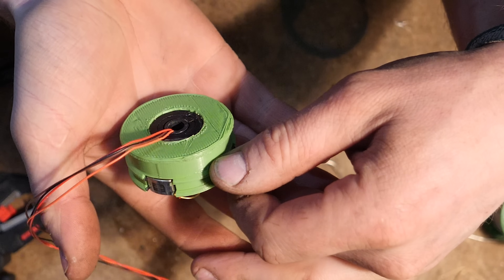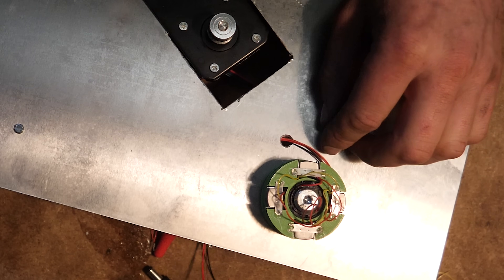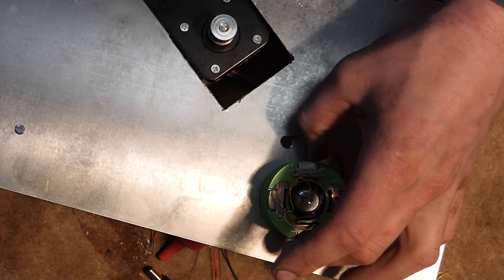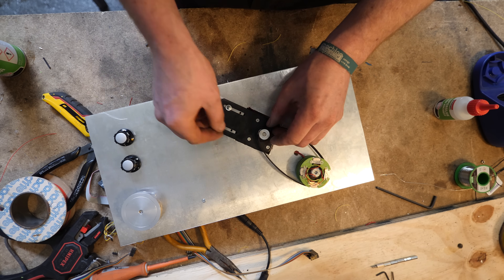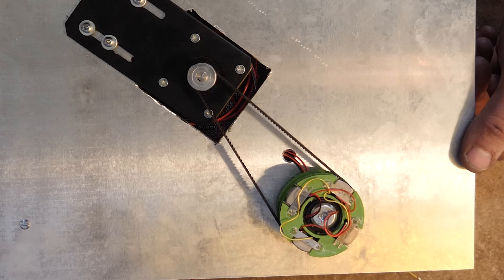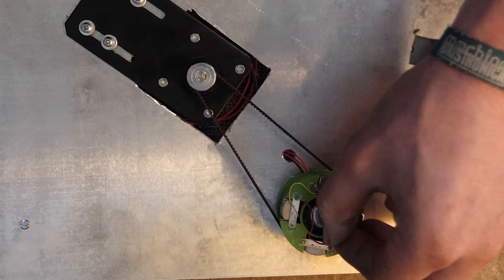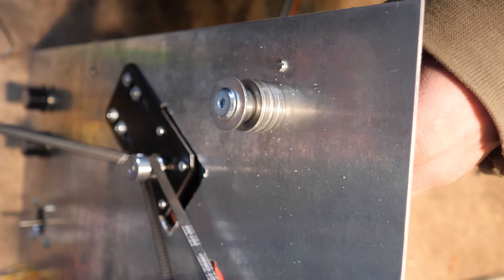It actually works. I've wired all of the tape heads in parallel so they're literally acting as the same tape head, and I'm quite pleased with that. It looks a bit rough but it is functional and that's all that matters. As you can see it's spinning freely and there are still electrical connections. The belt needs tightening up - so you push it back and add tension to it.